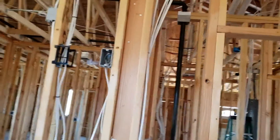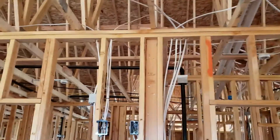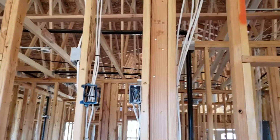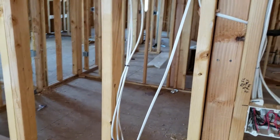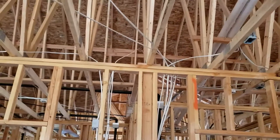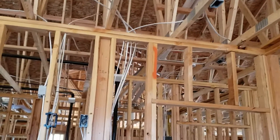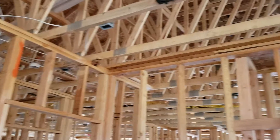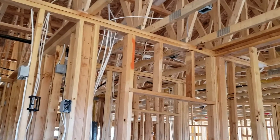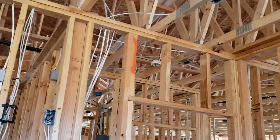Coax is not as critical because it's pretty well shielded, but I do recommend buying the best quality you can afford. Higher quality Cat5/Cat6 and quad-shielded coax will give you better end results. Remember, you have one shot to pre-wire this house. Once the sheetrock and insulation are in, if you have an issue it's a major pain — crawling in the attic with insulation, trying to find your wires, figuring out where the problem is. It could be something as simple as a wire too close to a major electrical wire causing feedback.